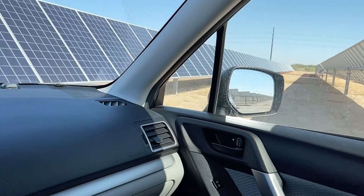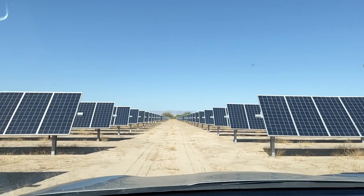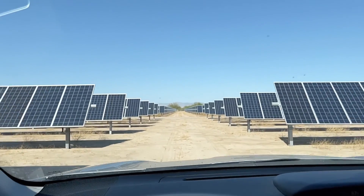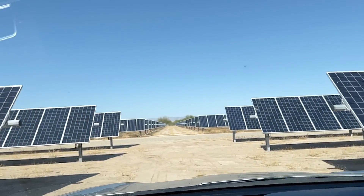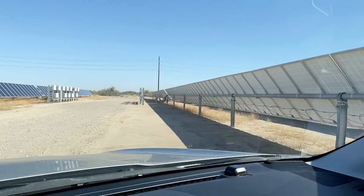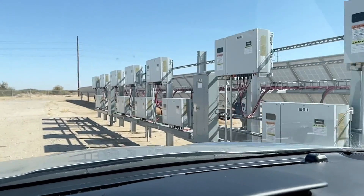Fixed two strings and heading back to the inverter rack. I'll turn on that one channel for the last circuit I fixed and make sure it comes online, then go look at the mesquite bushes that are threatening the solar panels. They look like a big weed but they have hardwood branches and are really tough — they can rip wires out and stuff like that. Just have to turn on channel 3 on inverter 5A5.